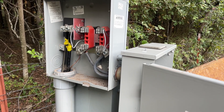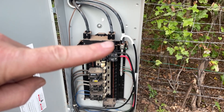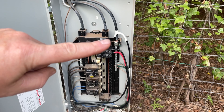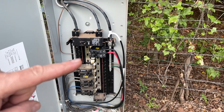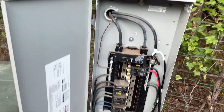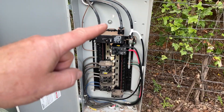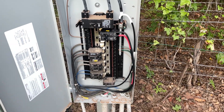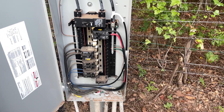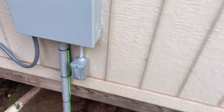I don't claim to be a professional expert, but I know how to do this. Our neutral wire is in the neutral lug — we've got our primary lead and secondary lead. We turned the power back on after putting the meter back in. When you pull the meter there is absolutely no juice going to those wires, so before we power things on we're going to go back to the other panel and make sure we have everything off, including the main breakers. They appear to be off, so it looks good.